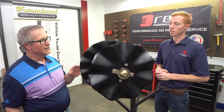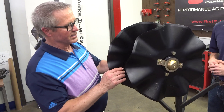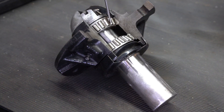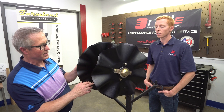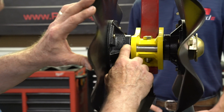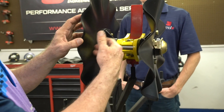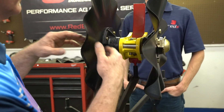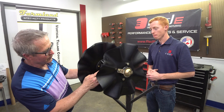The thing that's unique about this bearing: it's got two of the same size bearings in it. Instead of a typical Timken bearing set with a large bearing and then a smaller bearing on the inside, we have the same size bearings on both sides. Then we have a unique seal system where one retainer actually presses onto the shaft, and that helps eliminate winding with residue, pieces of twine, whatever debris might be in the field. And it protects that seal surface.